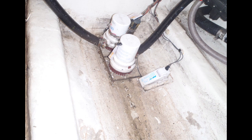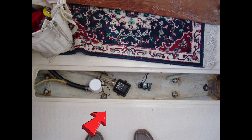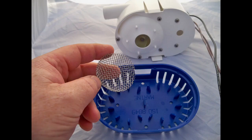Finally, some bilge pump tips and good practices. Tip one: test and verify operation of all bilge pump systems at regular intervals — quarterly at a minimum. Testing should verify the actual pumping of water overboard rather than, in the case of electric pumps, just switching the pump on and listening for motor noise. Tip two: make sure all bilge pumps have intake strainers or strum boxes installed and that they can be easily reached and cleared of debris. As a marine surveyor, I often see centrifugal-style pumps mounted beneath engines and completely inaccessible, even to simply clean the strainer.